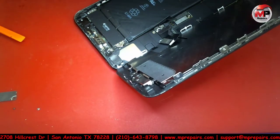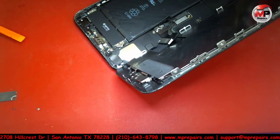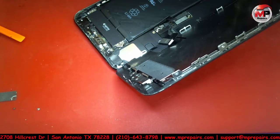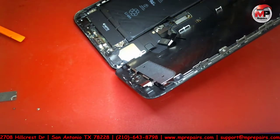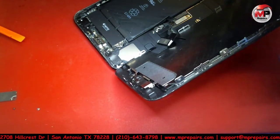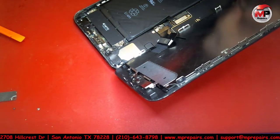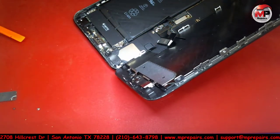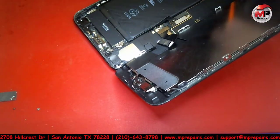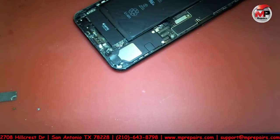And yeah, if you end up taking all the screws, put them in a bucket. And then you go and put your phone back together and start just picking screws and be like, okay, well, this one fits here. Okay, well, this one fits here. And then you happen to get one of the long ones that does not go in the deep holes. Yeah, you're going to drill through the layers of the motherboard. And if you initially had one issue, you're probably going to have a ton more. And I mean, this could be from backlight, from Wi-Fi, and God knows what.